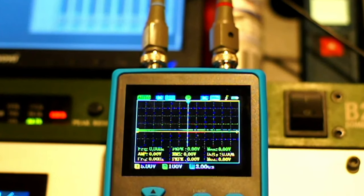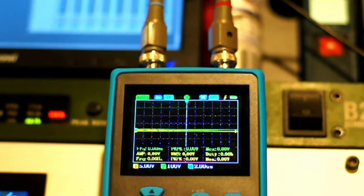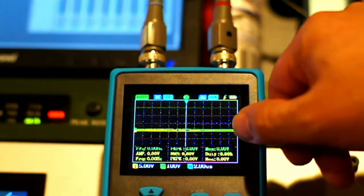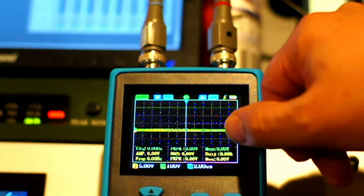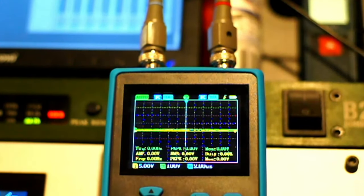When I turn on the switch, I want you to notice how the voltage is going to go up very gradually until it reaches 12.6 volts. And a moment later, a few seconds later, the 250 volt source is going to start up smoothly. The voltage that will be read here will be divided by 10. And I have the oscilloscope in extend mode so that I am reading the voltage in a scaled way so that the oscilloscope can effectively take that reading. That's where the switch is going to sound. You're going to hear it. Let's go.